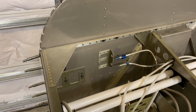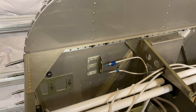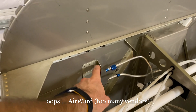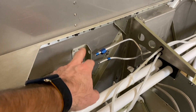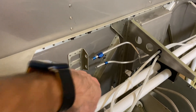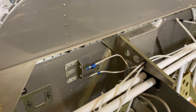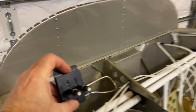I decided to put this parking brake in — it's the Air Ward bracket. The first thing I've got to do is remove this mount. I've already taken it apart and released the lines. I'm going to drill these rivets out because I use these same holes for the bracket, and I'll mount the bracket on. The bracket looks like this and will go onto the firewall like this.